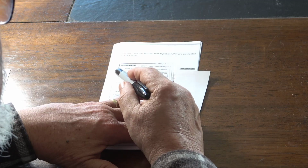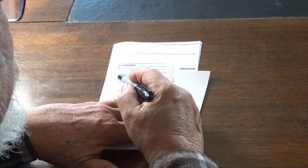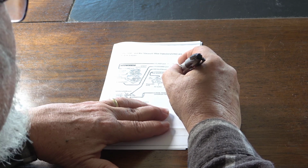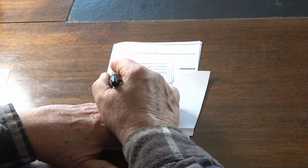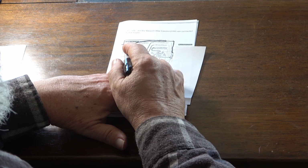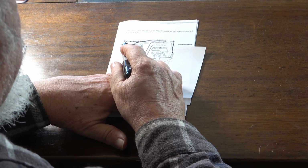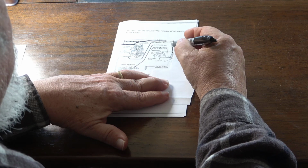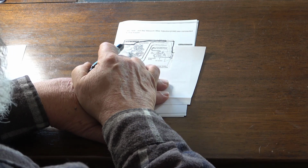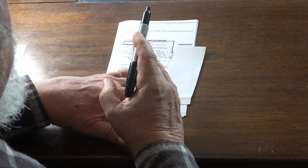And there are a number of sizes called out for the tubes that go to all these different portions. There is a port that goes to the clamping portion. So this is the air line that goes to the clamping system to actually cause the clamp to clamp. That's a good thing to have. Fortunately, the connector for this port right here is the same size as this port over here, which is really good. That means that the tubing that I already have installed will work just fine.